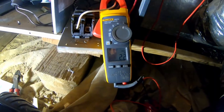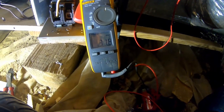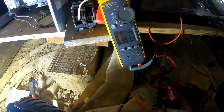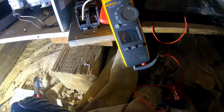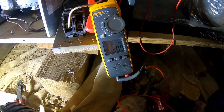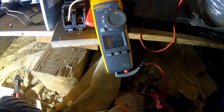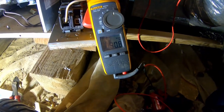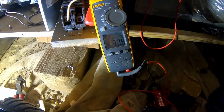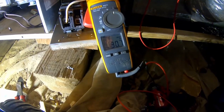I've got the fan switched on, so that made it do its thing. I'm going to go up there and put it on heat only and double-check the wires to see if they need a common hooked up. If there's a short to one of the other wires, that would just cause one of those other circuits to run without blowing the fuse completely and taking out their heat. There's the heat — it's at 30 amps, so they have heat now. Whether they want the heat pump to run too or if they're even using it, I'm not sure — I'll have to talk to them about that.